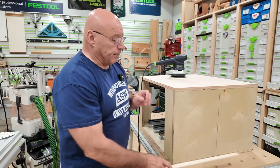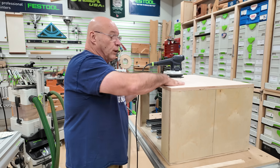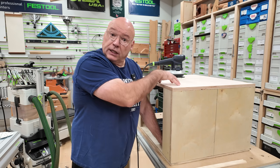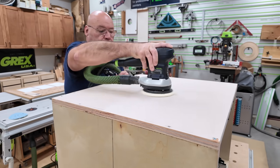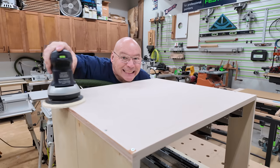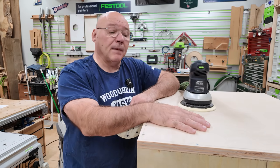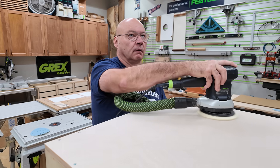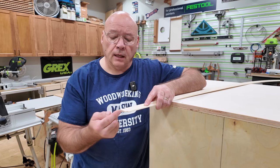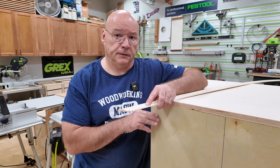Before I start, I'm going to sand this now if I have any marks on here, before I apply the molding. The paper I'm using for sanding will be my final sanding — I'm going to choose 150 grit, and then I will apply my coating in the future to the outside. So with this molding we're going to put a 45-degree miter on here, and I'll show you two ways of measuring this.